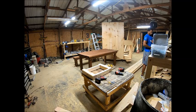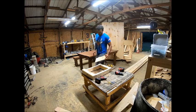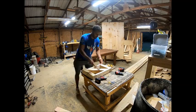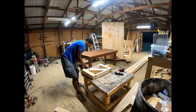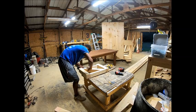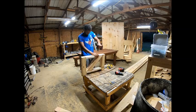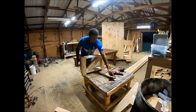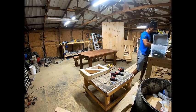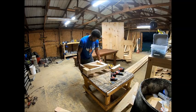Same thing with the other side — I grab what I have left of my 4x4 posts. You'll end up needing two 8-foot 4x4 posts for this project. When we get to the top, you'll need a 2x10x12, which should cover the whole top. This coffee table is roughly four feet long, about 27 to 28 inches wide, and it stands about 18 inches tall. You can change these measurements to however you need — this is just a basic farmhouse coffee table.